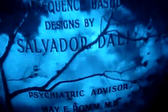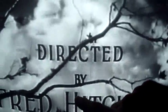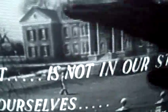Let's look at that picture — oh, that's a nice set. I think this is designed by Salvador Dalí. A good quick way to test linearity is: when something scrolls up on screen, if it stays constant width as it rolls to the top, you've got good linearity. You can see if the graphics get narrower or wider as they go up the screen, even without a test pattern.